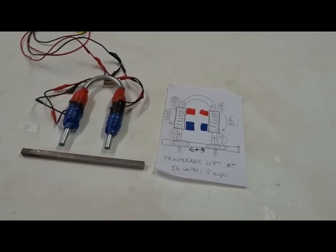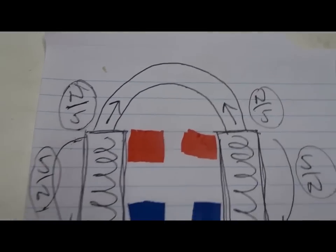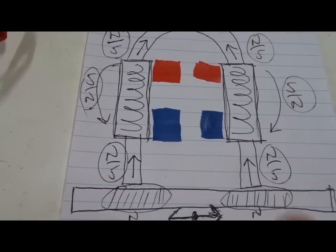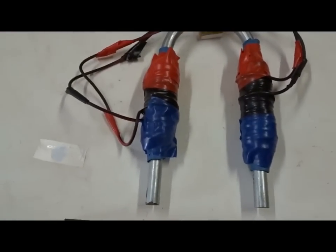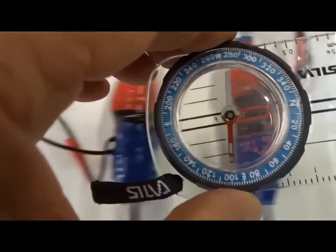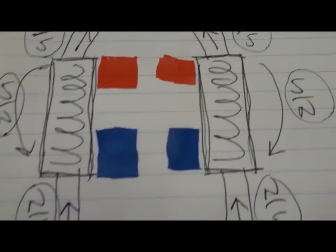To understand Ed's PMH, let's look at the first example where the two electromagnets are aligned in the same way. We have an iron bar with north-south at the tops, two south-norths on each side, and two north-souths at the bottom. Let's confirm that with a compass at four volts, 1.6 amps for safety. We see the north poles down on each side, and up on the bottom — just as expected. North poles, south poles, north poles.